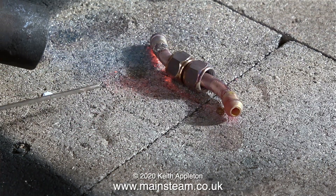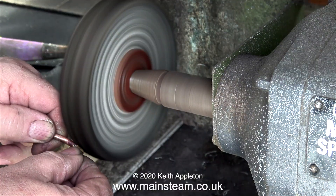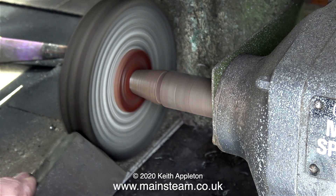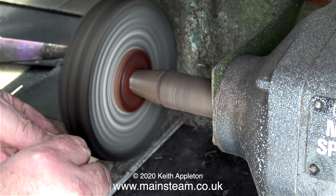In the outer part of the workshop I'm silver soldering the coned unions onto the end of the pipe. As always, for some reason when I make videos I use too much silver solder — I must try harder. After the silver soldering process I quenched the part in some water and then polished it up on the polishing spindle.